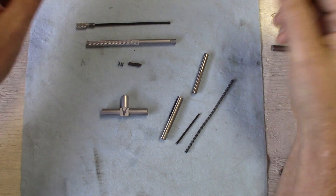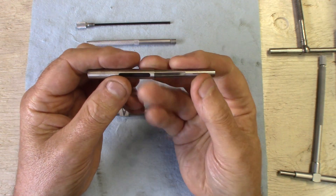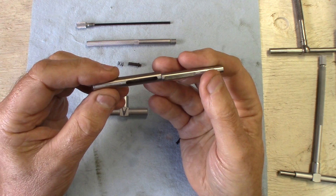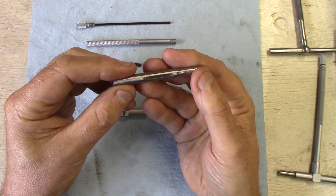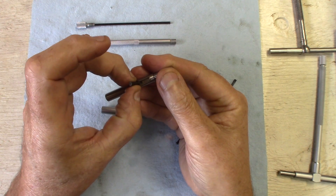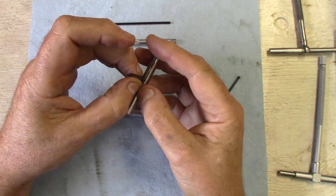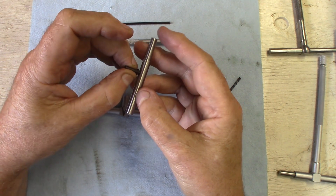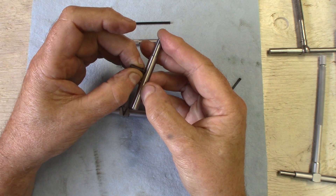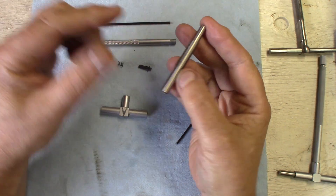The way it works - we got one of the telescoping parts and the other one. You see one with a partial groove in it, and one with a total groove in it, and they go over each other like this. That little pin, one in the body - this little pin will get into the two corresponding grooves and tighten this up to stop it from moving. Once you get into the part to measure, it will just collapse them a little bit and keep it there, so you have time to take your measure before they move out of place.